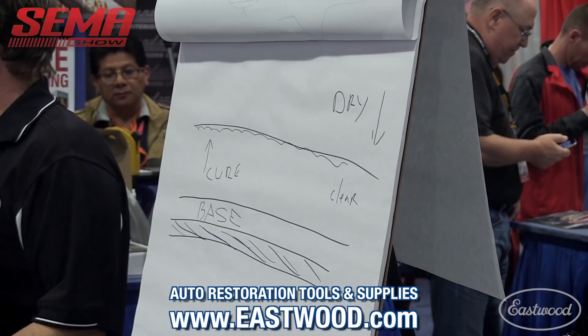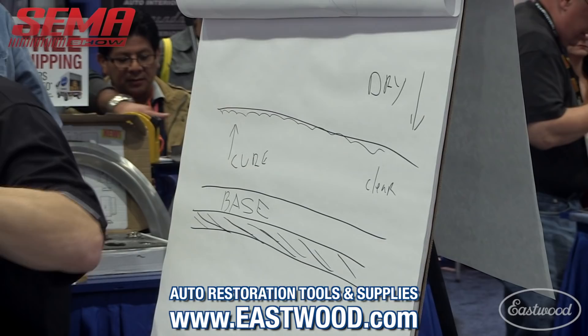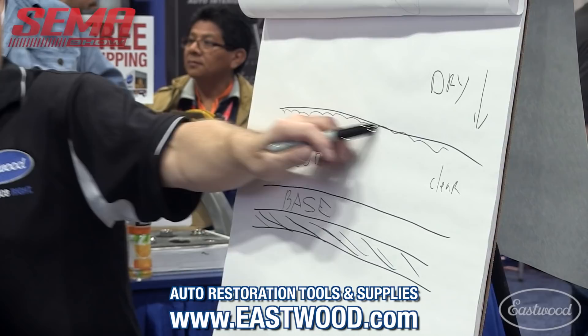If it's hand slick — what we call it in the south — you can touch it, you're probably ready for your next coat. If it strings off on the masking tape, then you're not ready for the next coat. With resin technology as it's curing, the good stuff floats to the top and you have a skin coating on the top, which incidentally also contains most of your ultraviolet protection — your protection against the sun and the elements. So you end up with this film on top that is your sun protection.